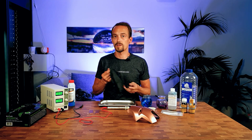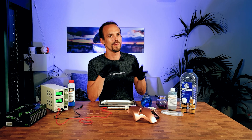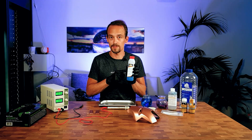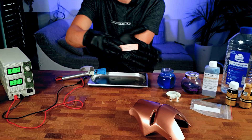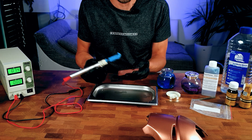In this step it is really important to wear gloves because this copper solution is acidic — it will actually hurt your skin. Make sure you use an acidic copper plating solution for this process — I'll link it in the description below. Once you start, you see an immediate color change. After just a few seconds, let's test if we have conductivity — not yet.